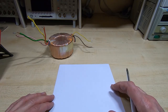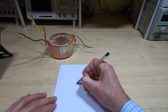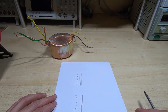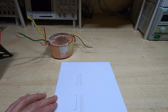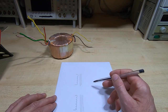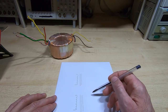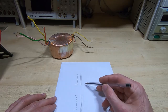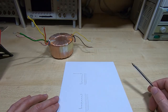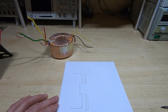Using my sketch, what we have is two identical transformers. What you would normally do is connect the inputs in parallel and configure the outputs — either as two 48 volt windings in parallel or two 24 volt windings in series. But instead of winding these as two 240 volt windings requiring 600 turns each, I'm actually going to wind them as 120 volt transformers and connect the primaries in series.